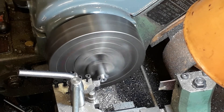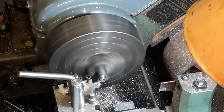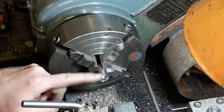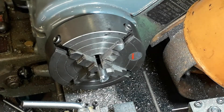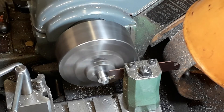That's the final pass to get down to size - looks nice. I'll just take that edge off. What we're doing now is using the rear tool post again to put the groove in. This one needs to go down - I think it's about a sixteenth of an inch, just check the plan. This is for the end of the bow rod which screws through the eccentric strap and locates into this groove.